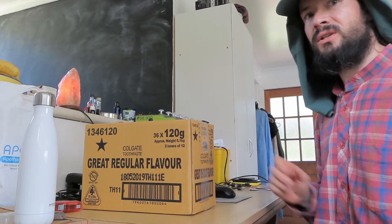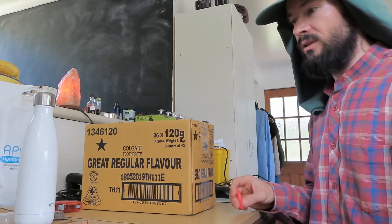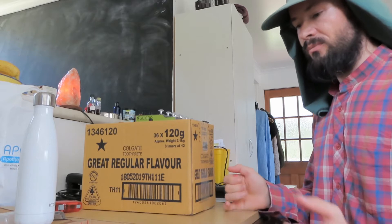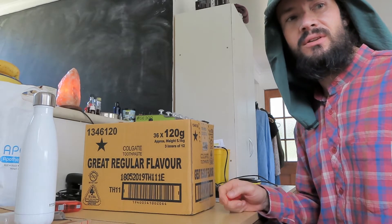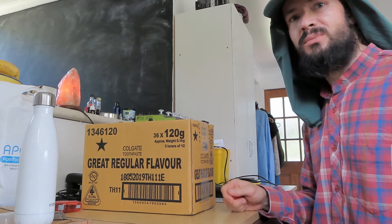You should still make sure that your jack is as level as possible and put a brick, a block of wood, a plate, or something under the jack to give it as flat and stable ground as possible.